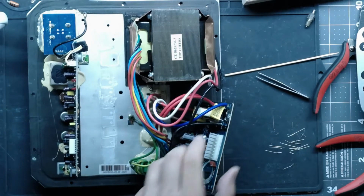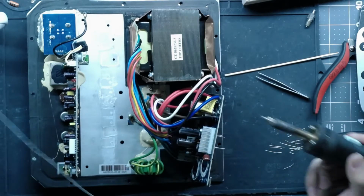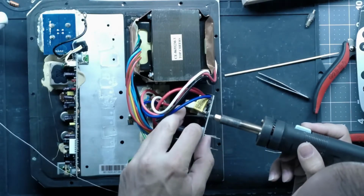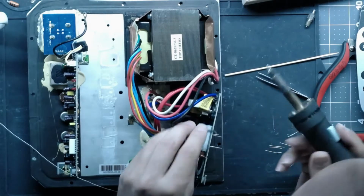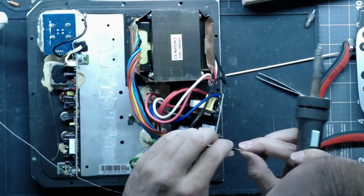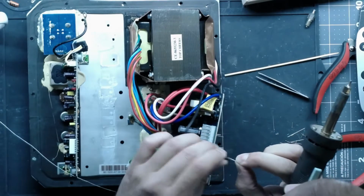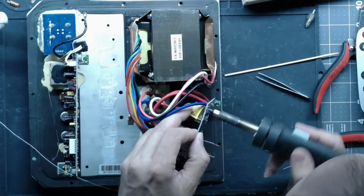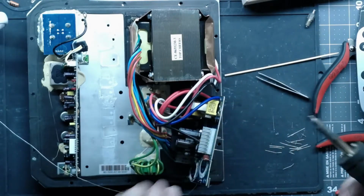Let's fix this cap now. This is atrocious. I have my wrong solder sucker tip on there. Actually, I'm just going to take the whole thing out because this wire needs to get redone. Actually, the wire's not bad. It's not frayed. It's holding solder. It just has a really, really thick jacket on it. Alright. The filtering will do some filtering now.